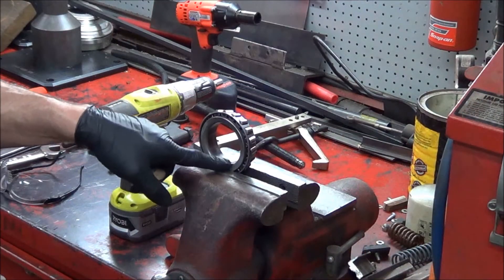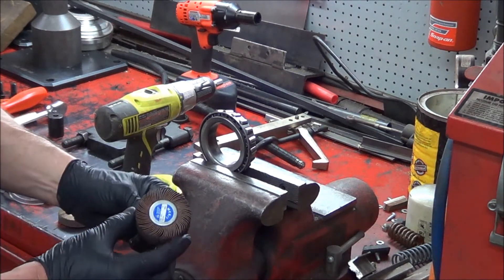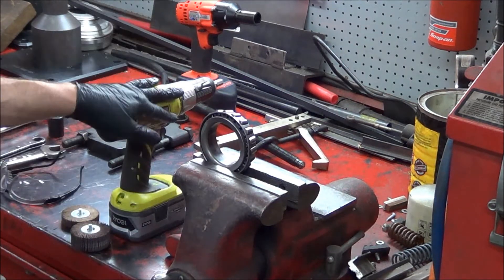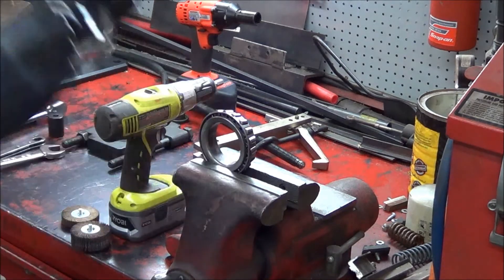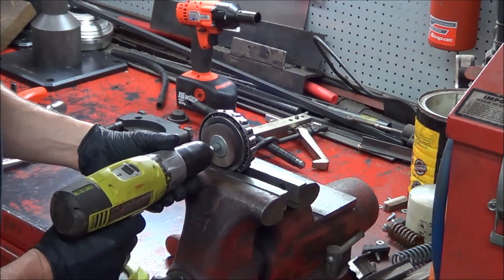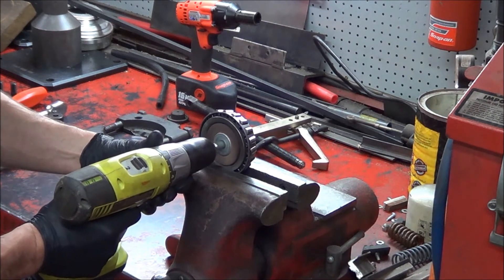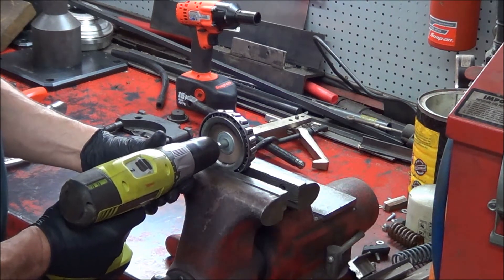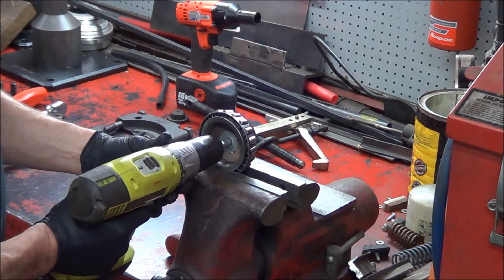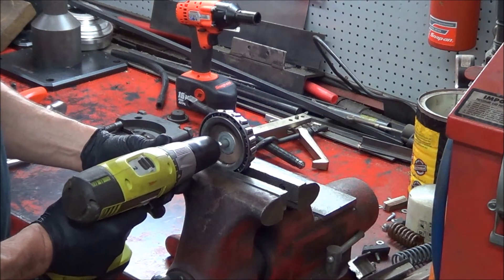Here's our bearing — I've got it in the vise here. To do this, I use a flap wheel. This one here is 60 grit, and then I follow up the polishing with a 120 grit and of course a cordless drill. Safety glasses, of course. This procedure takes probably about five or six minutes. It's best to basically hone, check, hone, check, et cetera. Once you're close, then you can switch over to the 120 grit and give it its final polish.